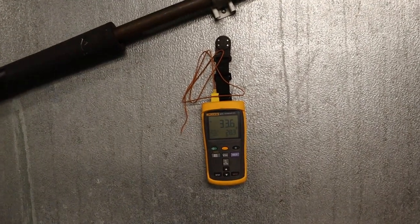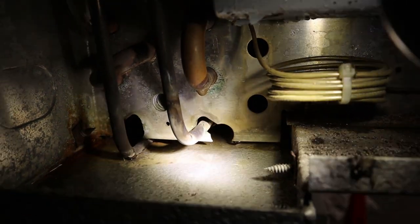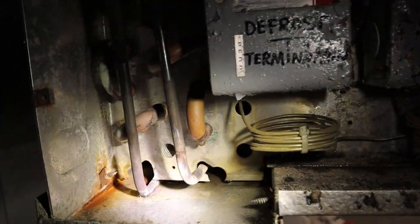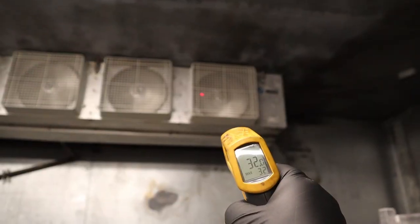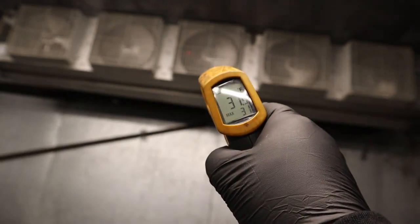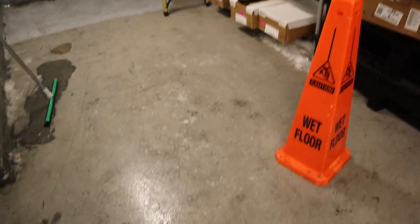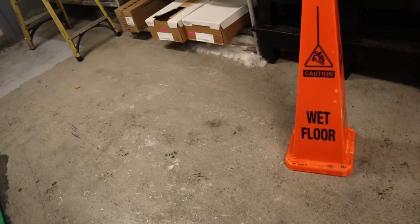It's just dripping over — we're going to open up that drain. 33 degrees, I'm liking it. In the drain pan the water is all clear, no more ice. Just have to open up that drain line. I can't see that much ice anymore. 32 degrees — looking good, Billy Ray; feeling good, Lewis. We just have to clean up that mess, run it through a couple defrosts, clean up that ice ring, and that should be it.